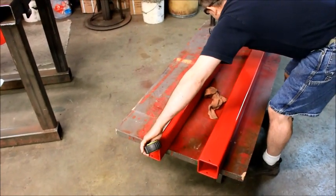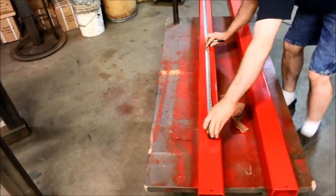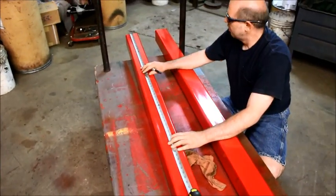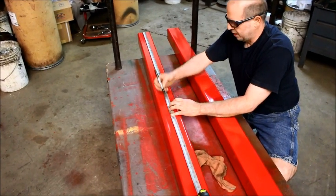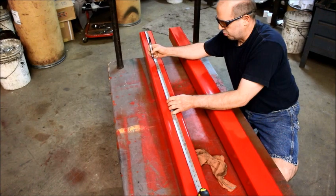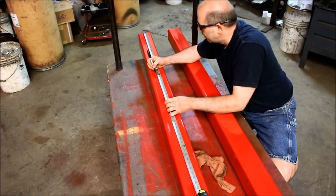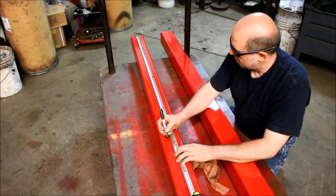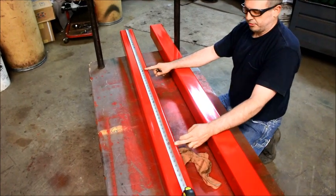The front bar we're going to lay out for our A-frame, again, same aspect, find our center, which again is 36, but in this case we're going to do our drops. For Cat 1, or Category 1 A-frames, it's 26, so 26 would be 13. We'll take it to 23, sorry about that, 23, add 13, would be 49. That'd be your locations of your drops.